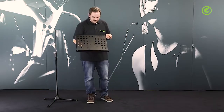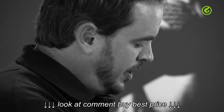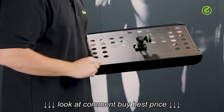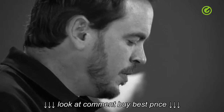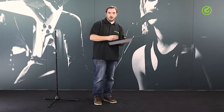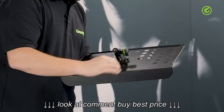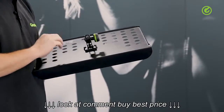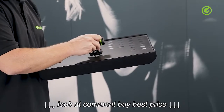Let me say a couple of things about the plate itself. It's perforated steel — the additional holes help reduce weight a little bit. The really cool thing is the joint in the middle. Some cheaper stands do this part with bent metal or bent steel, which is fine, but the problem is you have fairly high tolerances, so sometimes there might be a millimeter more or a millimeter less, meaning the joint can sometimes jam. What we've done is used aluminium die-cast tooling, so it comes out of a tooling and is always exactly the same with very low tolerances — this part just slides in and out very easily without jamming anywhere.